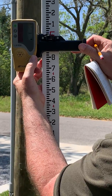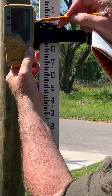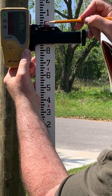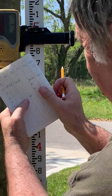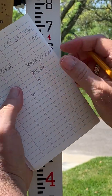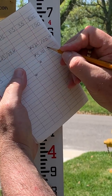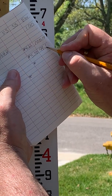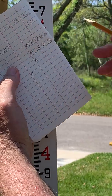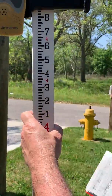As we come down into the beam, we have found a steady bar. If we read across the blade, it's 5.00. So the side shot to point number three is 5.00. That's a pretty easy subtraction — if we subtract 5 from 104.63, we come out with 99.63. So we can see that as we're walking through this, the numbers have made it a little bit easier, which is why I'm doing the math as we proceed through this series of shots.